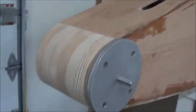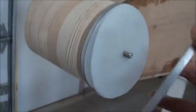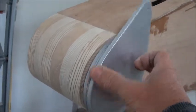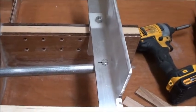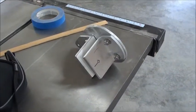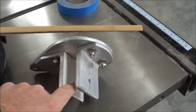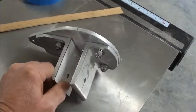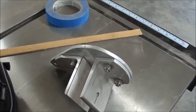We've got part of the steering chock on here — a plate and a plastic bushing. That's where the chock will be hooked to for your steering arm. Now we're assembling the steering chock. I've got some plastic laminate glued in with five-minute epoxy to use as a bushing against the runner stiffeners, so we don't get any galling with aluminum on aluminum.